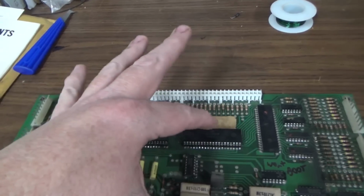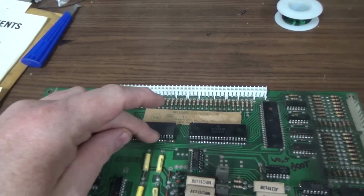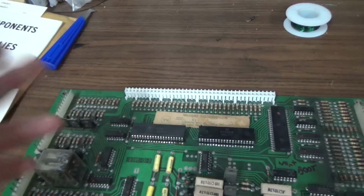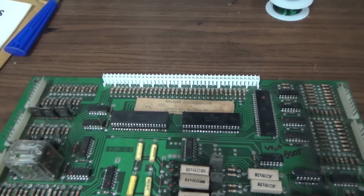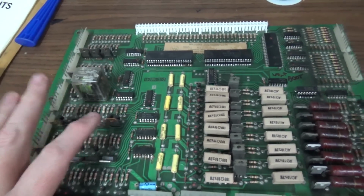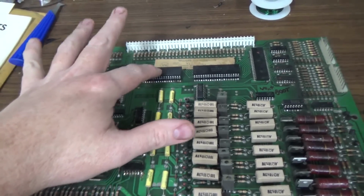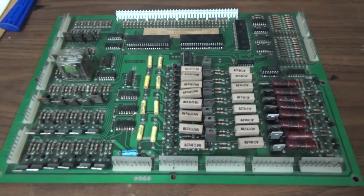It's also the only one that hasn't been socketed yet. You could have a situation too where the socket was installed bad, and so maybe a couple address lines are shorted together or something, and that's messing it up. But I would just guess that PIA is probably messed up. So what we're going to do is go ahead and mate this to the CPU and then turn it back on, and then we can check these PIAs with that Leon's test ROM